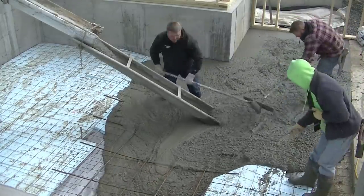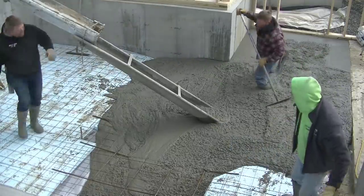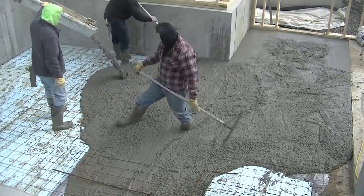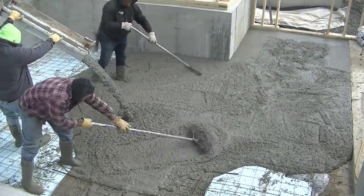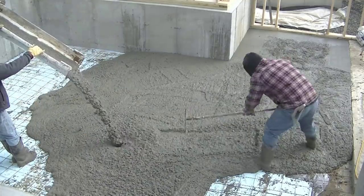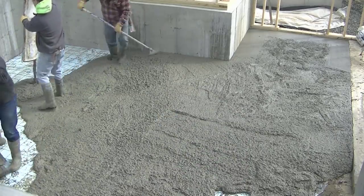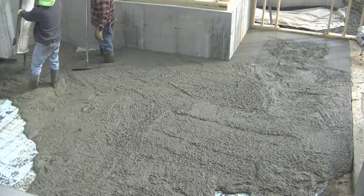So we're pouring the concrete here. This figure is about five to six yards at four inches, but it was actually a five to six inch thick floor. That big thickened area in the middle is going to be some support for the framing — that took about four yards right in itself just to fill that. We had to match the other slab, so we couldn't really change the elevation of the floor at all. I've got 13 and a half yards coming down here — six and a half to seven yards on the first truck and about six and a half on the second.